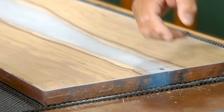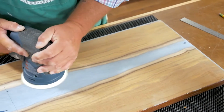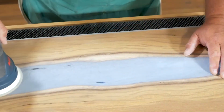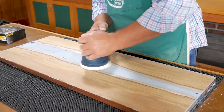Don't be afraid to repeat this process as many times as you need until the entire top is perfectly flat. Here's another tip: don't apply too much pressure to the sander. If you apply too much pressure, the sander will actually dig in on the edges and create little depressions in the top of your workpiece. So apply even pressure and let the sander do the work.